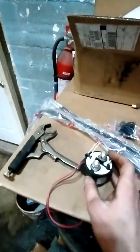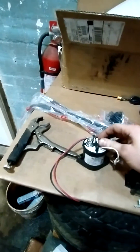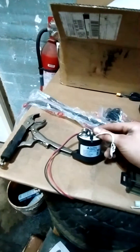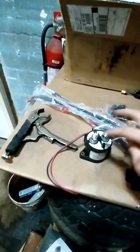This is going to be a relay because the BMS is so expensive to have one that would flow enough amps. So the BMS will actually run this EV relay, and all the power will flow through it.